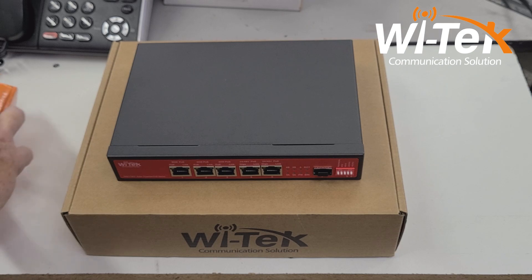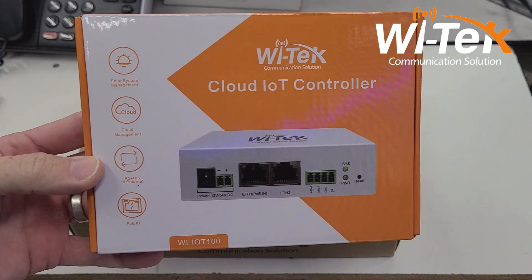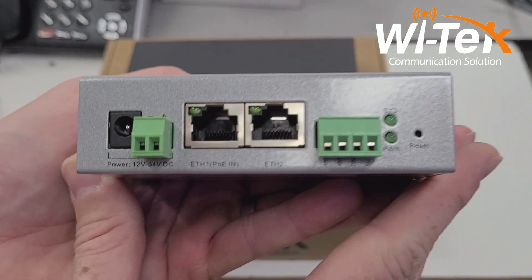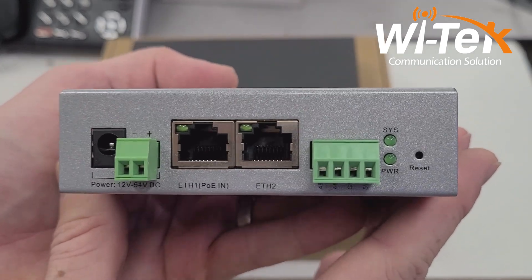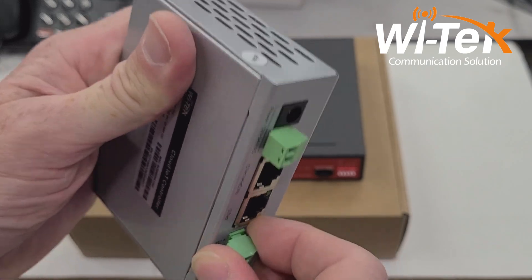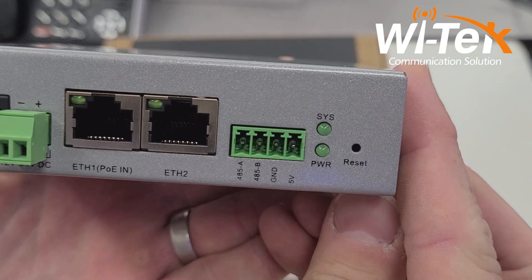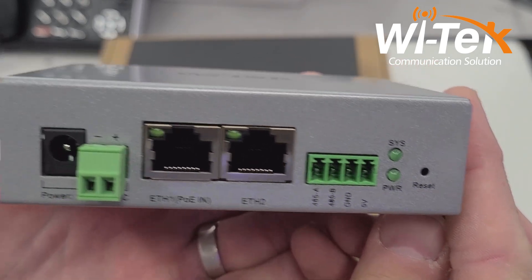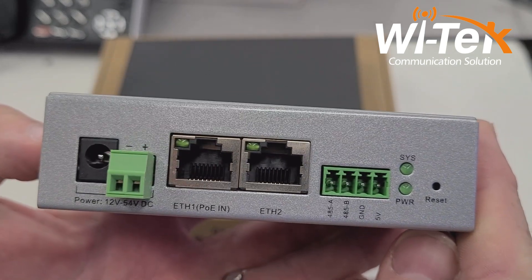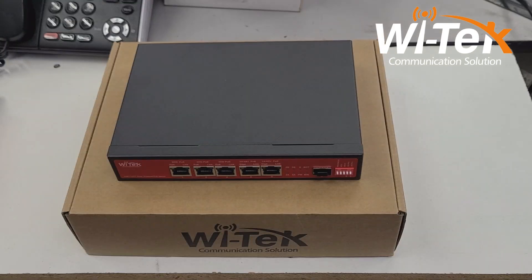While the switch on its own is very cool, the integration of an IoT controller from Witek takes it to the next level. Using the integrated RS-485 connection from the switch, this box will allow you to remotely see the solar charge rate, the load capacity, and the current battery levels of your solar deployments. It also allows you to see all of these same metrics over a time period, and you can export that data out of the system into Excel.